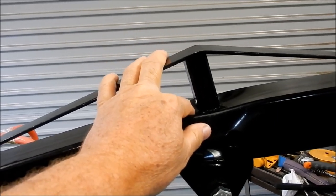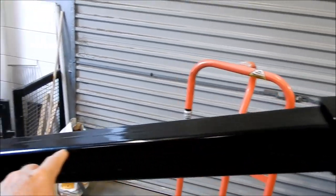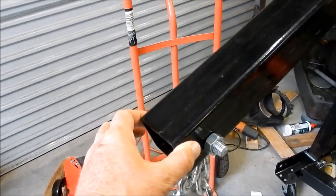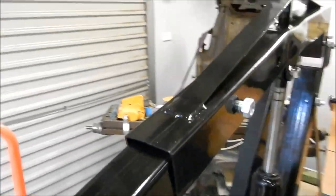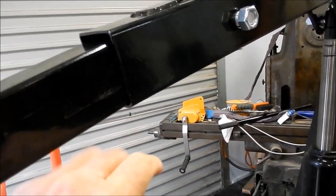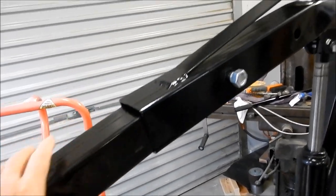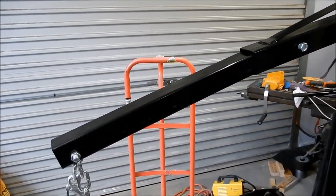You can see how the deformation has occurred where the force was applied, and the truss support post is also deformed into the steelwork. Being only 2.5mm there's certainly not a lot of support - it has oil-canned in there. If I take the arm out we've actually bent the arm as well. It's slightly thicker at 3mm but it's an odd size again at 60mm, and there's an awful lot of slop in there. We've also deformed underneath where the load came on - a 2.5mm thick plate - so lots and lots of issues with that arm.